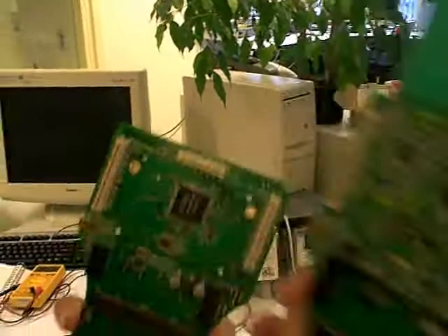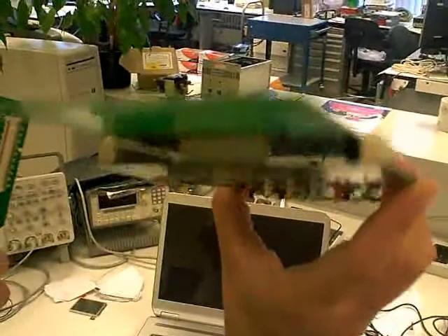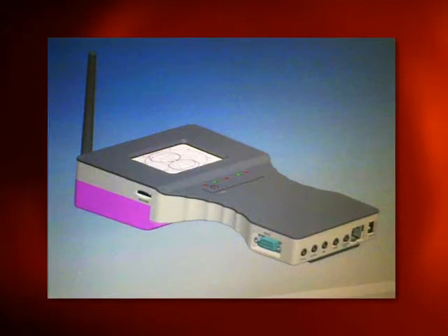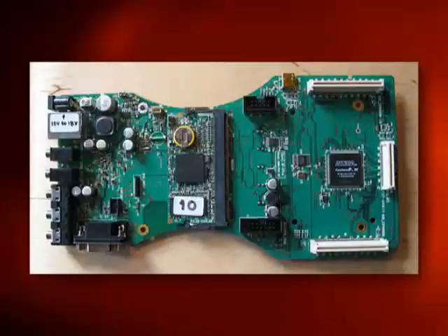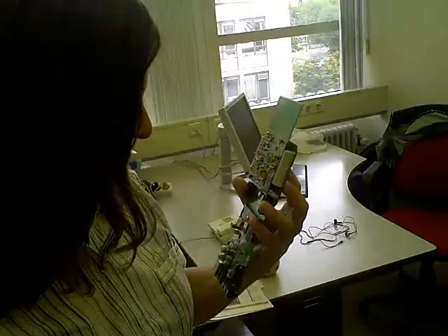You can see what this looks like in the version without the analog front end. This is our Cyclone 3 FPGA. You can see the connector for the analog front end and two expansion connectors on either side — all the pins of the BlackFin DSP are exported. This allows people to cobble together their own extension modules; for example, if they'd like GPS or similar, they can just build their own board and stack it. We're still debugging the analog front end, but we're hoping to have the entire commercially mass-producible system ready by Christmas, and definitely within a year we'll have something we can put on the market.